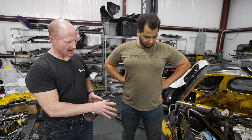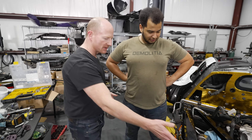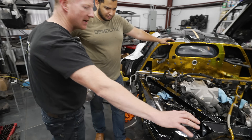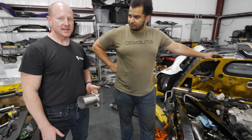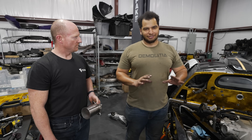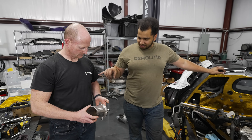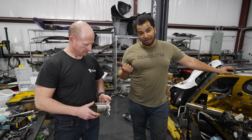Because we were planning on pretty big power, we're going to start with four inch right off the turbine, and then as we come into the exhaust we'll taper into three and a half, and we'll do a three and a half inch titanium X-pipe. We're doing an X-pipe so it's going to look fantastic. We're using all Tycon products and he's gonna be TIG welding this entire thing.